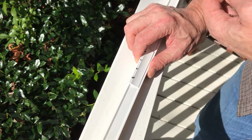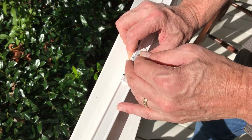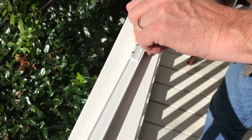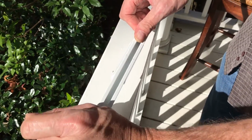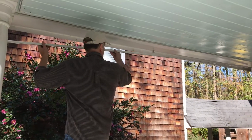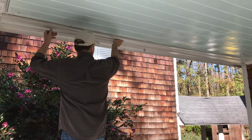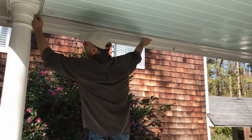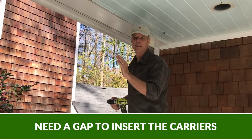This is a 12-foot side. So what I'm doing here is I'm going to put 2 8-foot tracks together. It's going to be a 16-foot track. I'm going to hold it up, mark it, and cut it. So the most important thing is, while it's down here, I need to get my joint right. Okay. We got a good tight joint. But I don't have to worry about being wrong on any math. I can butt it up there. I can bring it over here to my 2-inch gap. And mark it. Okay, so what's important is we need a gap on any given segment.